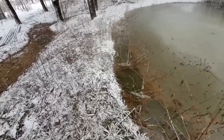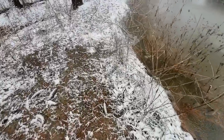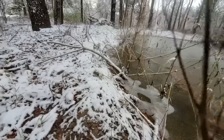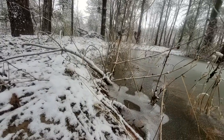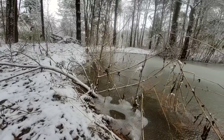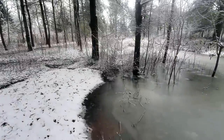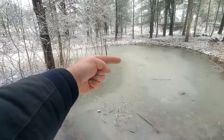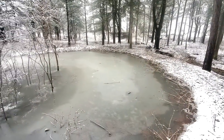And right now I'm seeing that the berm, we're at the high water and overflowing state. It's definitely fine enough, but there's some pockets right in here where a little bit of fragility is being exposed. If we had an immense amount of water coming in out of nowhere, the water level might be able to hop over that. I think we can provision for that emergency to not happen, and we would do that by assessing the designed-in spillway. So the place the water would want to leave is just to go down slope and fill and overflow, waterfall and keep going. And that would be super destructive to this.